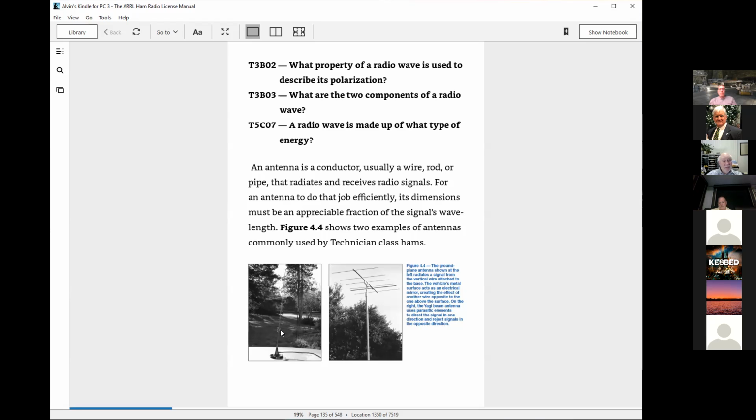Anyone know what that coil means? It has to do with resonance. I think we talked last week or the week before about resonance and how a resonance circuit can either block a radio signal from coming through or let it go through. Well, this is a resonance circuit that will block this part of the antenna from being used. So this will be resonance for the 440 band. That's the trick they use. There should be a capacitor along with this coil at this 440 frequency. The wire itself has enough capacitance to act as the capacitor.